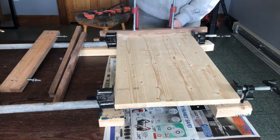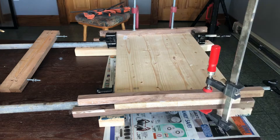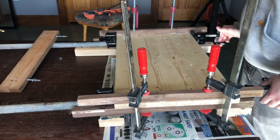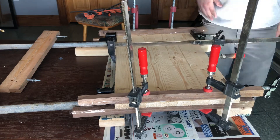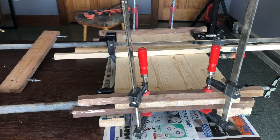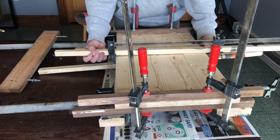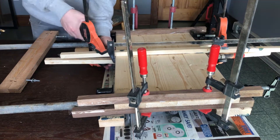This is a great pro tip for large panel glue-ups. If you don't do this, you have a big tendency for your panel to warp once it comes out of the clamps. If you do it this way, you have a much better chance of keeping that panel flat and true. After all of your cauls get put on, you're going to want to go back through and make sure every clamp is tight.